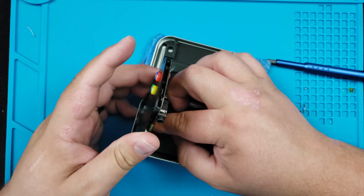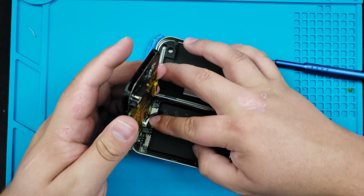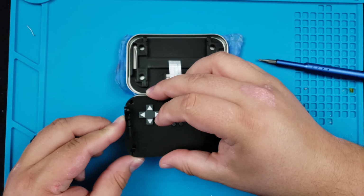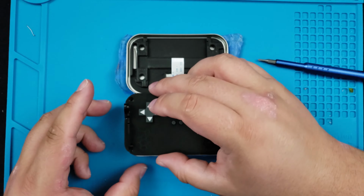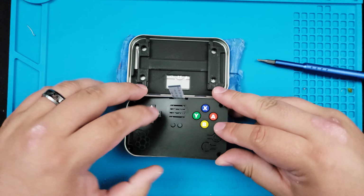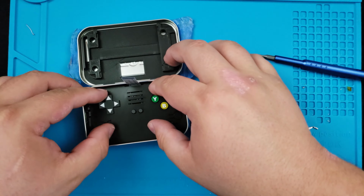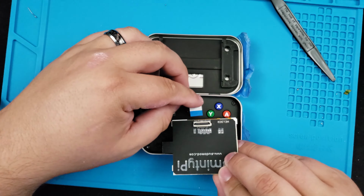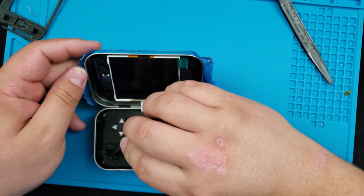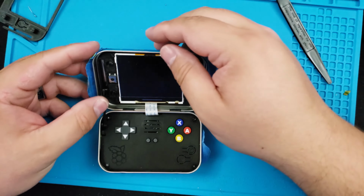We'll attach that wiring harness to the top board and set the left side in first after adding our hinge. Just be careful snapping it in, but it should fall in nicely. And add your 4 screws. Attach your LCD. And it'll sit nicely in there.